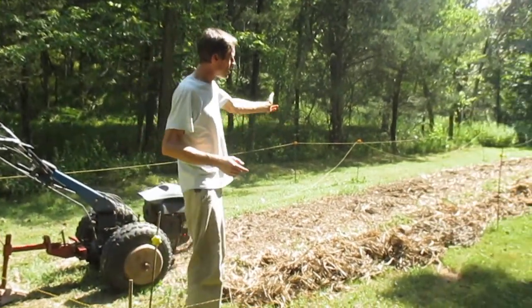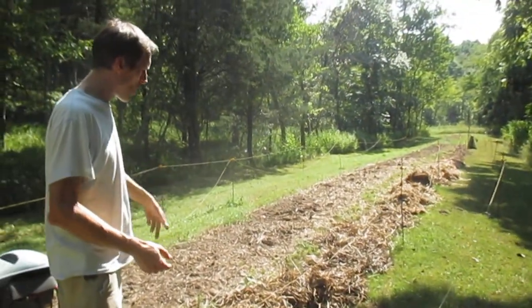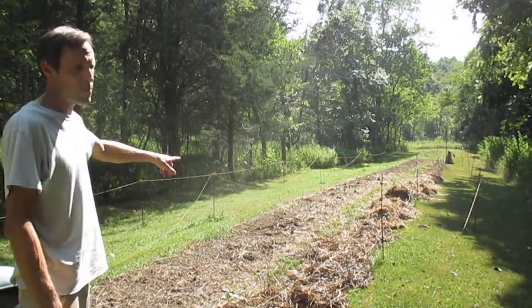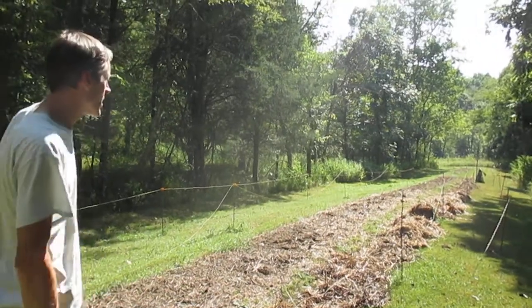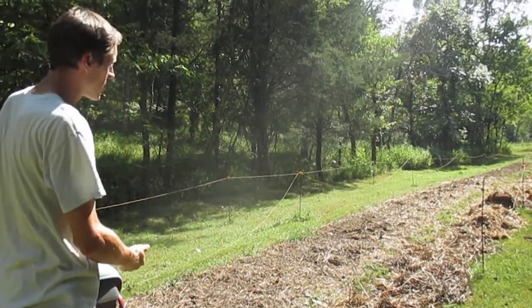Note that we've already raked off — actually my lovely wife has already raked off — all the mulch and old dead potato vines. If you try to dig potatoes with one of these small tractors while pulling through all that residue, you're going to have a terrible time, because that stuff will just ball up on the front of the potato digger plow and impede traction. So get all of that raked off first, and pick up any potatoes you see exposed on the surface.